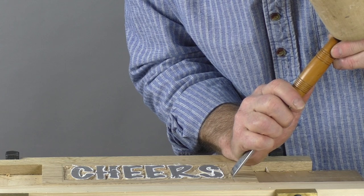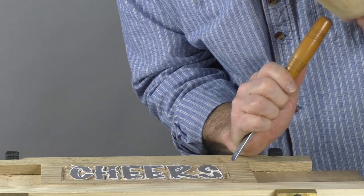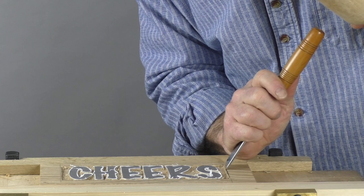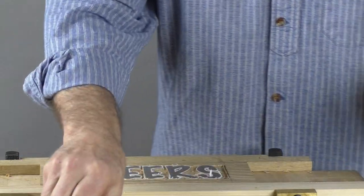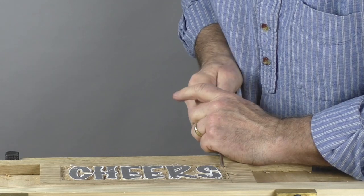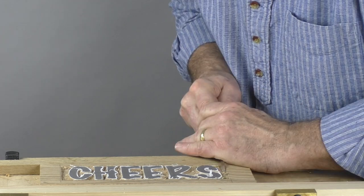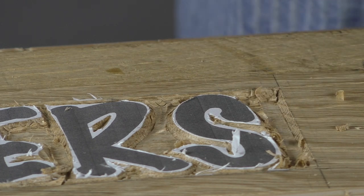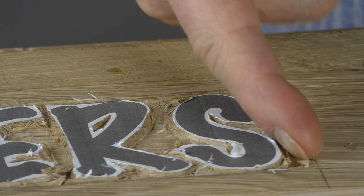Start off — I can put it right into that score mark at about 10 degrees and I've got to marry that into the next one. Then I'm going to use my slightly narrower gouge here. You can see it's coming off — take the background up to there, and this is now the finished surface up to that edge. A little stab mark is okay — you can stab into the wood, but lightly. When we come to the corner I put in a little stop cut like that and then start coming across here.